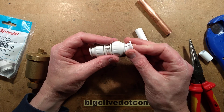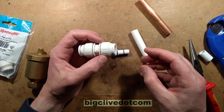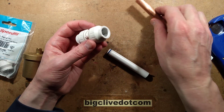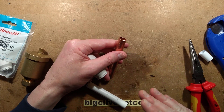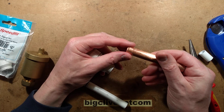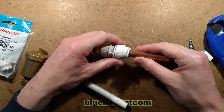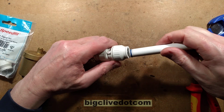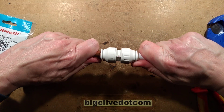This little insert pops out every time I've tried that. This is my play piece — that's why there's a little red dot there, just to mark this is a bit I've been playing with quite a lot. I probably won't end up using it as a precaution since it's not fresh. But the idea is you can put a copper pipe in there as well. The biggest issue with these has been people hacking the pipe off with a hacksaw or junior hacksaw and leaving the end all rough — you're supposed to file or ream the end to make sure it's smooth so it doesn't damage the o-ring. Once you tighten that up it's pretty solid. Basically you just ram it in until it goes up to that mark, tighten up, and that's your solid connection.